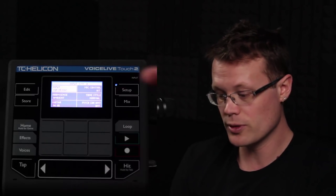I'm going to say, okay, condenser mic is next. Well, condenser mic is any mic that requires phantom power. So you're going to have to check and see whether or not your mic needs phantom power. Make sure you're using a good grounded XLR cable so that that phantom power can get along the lines there. And then plug it in, select condenser mic, and your mic will turn on. So that could be a reason if you're not hearing any audio, but you have your mic connected, double check that you don't have a condenser mic that needs phantom power and it just isn't turned on yet.